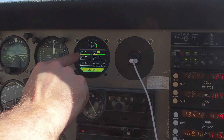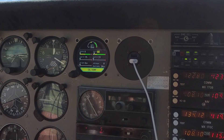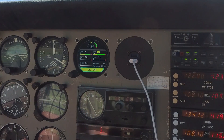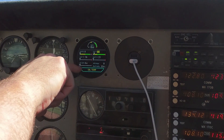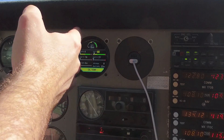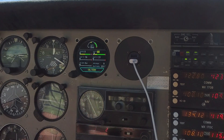Now, the oil pressure PSI scale is a little off — I'm going to have to get that adjusted. What you'll notice is later on, especially after the engine has warmed up and we're coming in to land, you're going to see the oil pressure actually indicating low. Right now we've got an oil temperature warning because the engine isn't running. However, we'll get the same kind of warning for oil pressure once the engine's warm and we're at low power. That's normal — it's going to drop below 60 PSI where it's set now. I'm thinking about dropping it about 10 PSI to hopefully take care of that issue, but that's for another day.